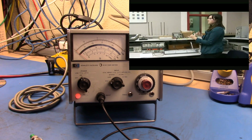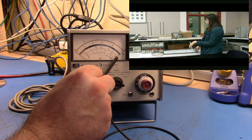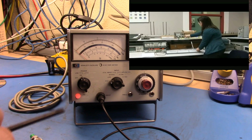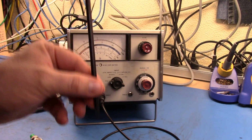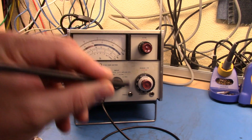But when you do that with the slotted line, that lets you use the SWR values here. Let me grab my little pointer. The SWR scale directly. Effectively the slotted line is a way for you to get a probe in, and the waves propagate through the space of the slotted line. So it's basically just a cylinder with a hole cut down the side, and then your crystal detector slides along that slotted line, and you're trying to find the peaks, because with the standing wave ratio, it's where all the waves combine and subtract. So you want to find the maximum peak and then the minimum peak.